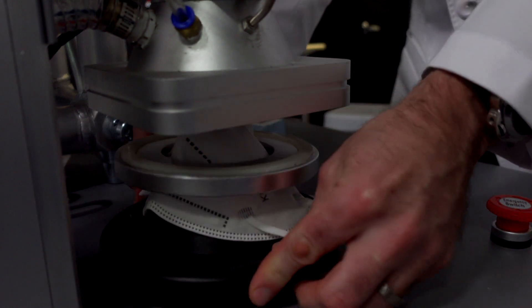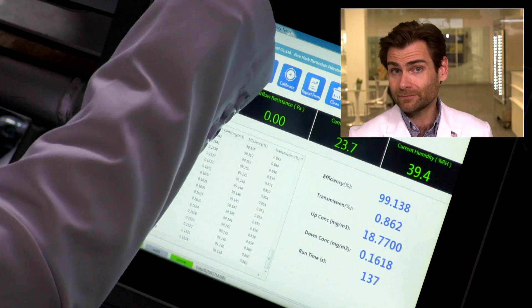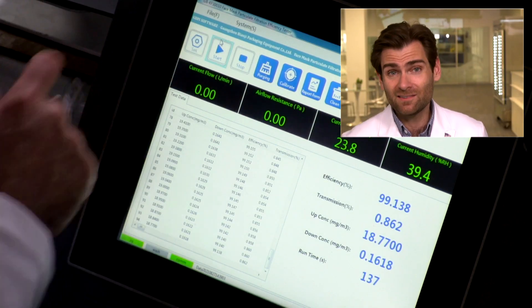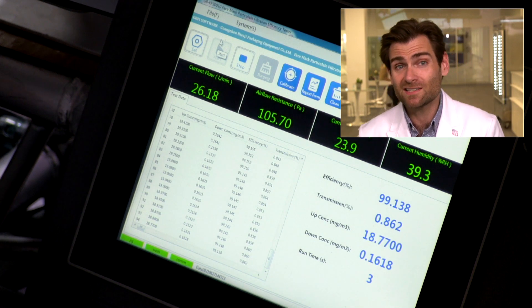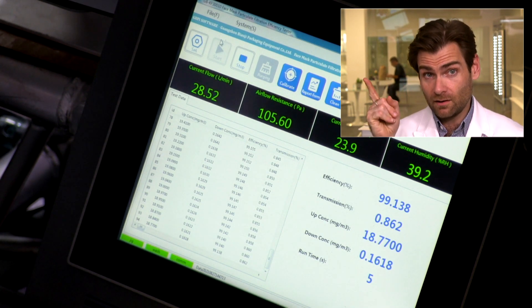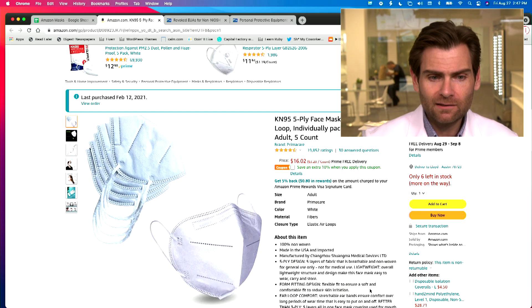Even without a lab coat — that's right, lab coat not required. This is a PFE machine — Particulate Filtration Efficiency machine. We're testing with NaCl today. If you want to check out how that works, go there. One other note: we are just looking at the filtration of the actual fabric. I can't test the fit on your face because I ain't you, but you can just make sure it fits — it's not rocket surgery.